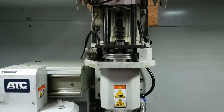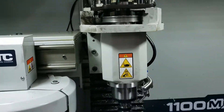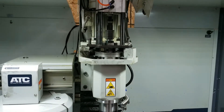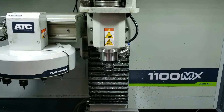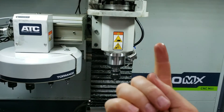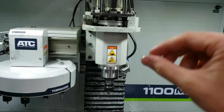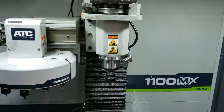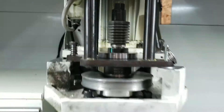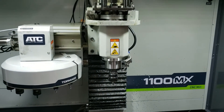After running this through a few cycles, I think it's actually going to work pretty good — I think I got it dialed in within spec. Reading the user manual, I also think some of these parts are running kind of dry. The manual calls out using anti-seize on the pull stud itself, and then using the anti-seize-coated stud to deposit it up inside on the forks. It'd be hard to take it apart and get at the forks directly, so this is the approach. I'm also going to add some penetrating oil and grease to the assembly up top — I think there's some binding from dryness. Right now it's actually running pretty smooth, but this will be extra insurance.